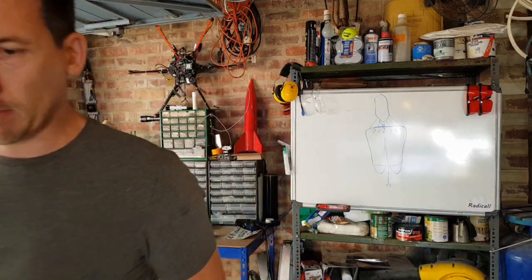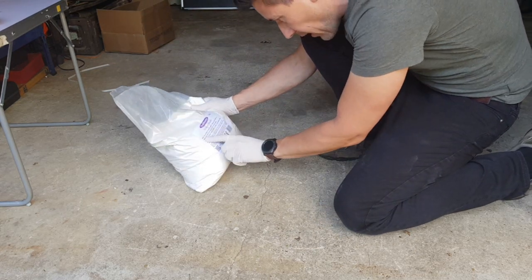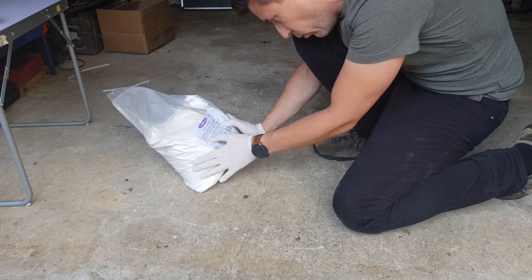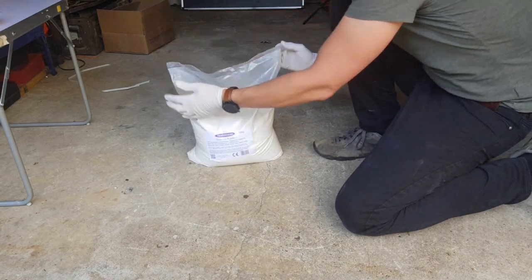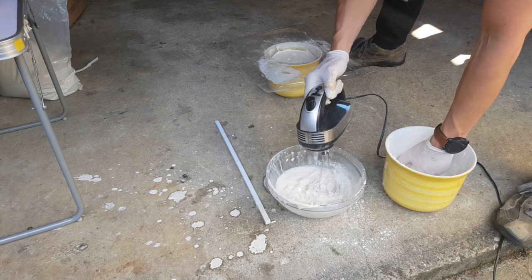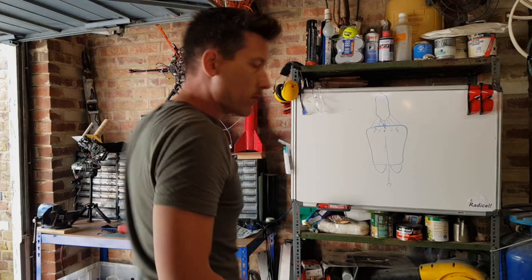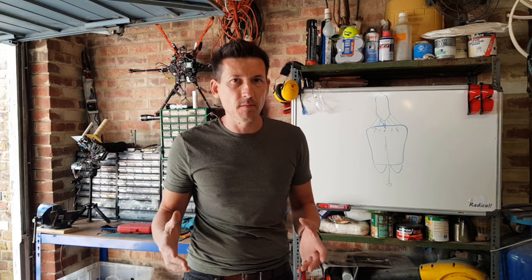Let's get mixing. Stone cast powder: add one kilogram of powder to 500ml of water - always add powder to water. Mix thoroughly to a creamy paste. Using less water makes it harder, more water makes it softer. The mixture will be workable for about 10 minutes and sets in about 20 minutes from mixing. I've mixed it up and poured it in - I've got to wait 20 minutes to see how it comes out, hopefully hard enough to use as a mold.